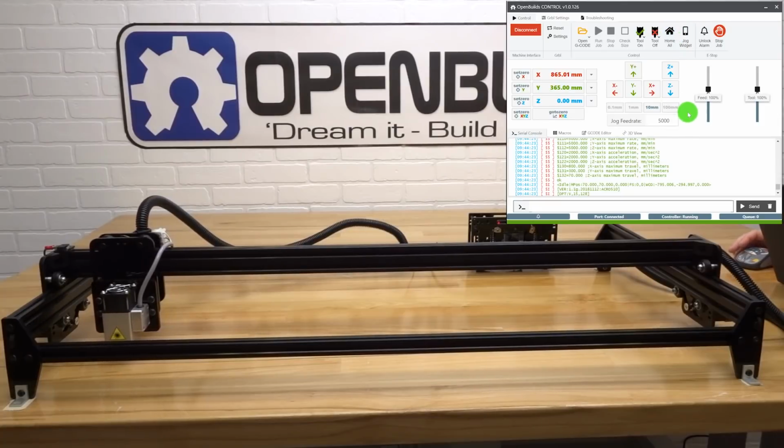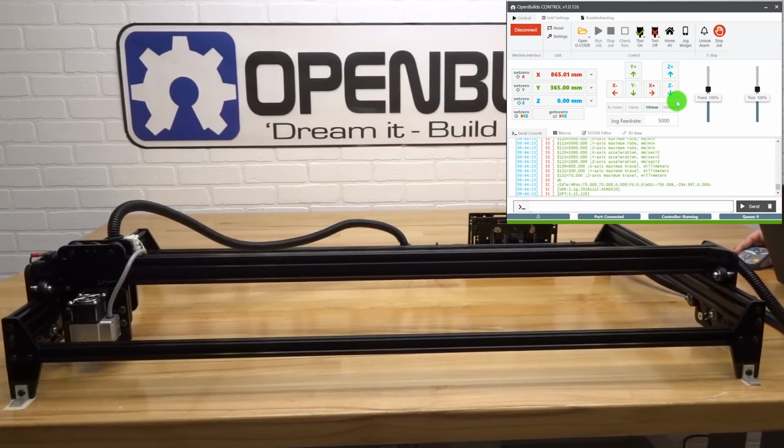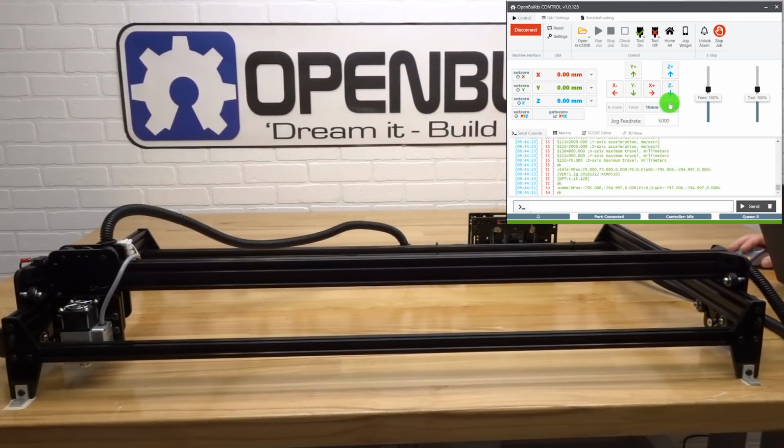As you can see, the machine is moving to the X-axis first, and then it will locate the Y-axis. Moving to the front here, it will complete the homing cycle. It goes back 5 millimeters, which is part of our settings, and finds its homing position. Very convenient for any type of manufacturing. When you're running a job that's all the way in the back right corner and you just want to home your machine, that's how you do it. You just press a button. It's awesome. Very nice and very intuitive.